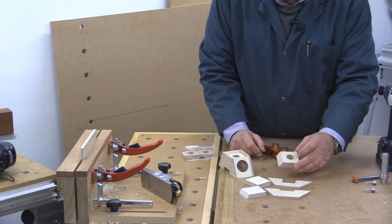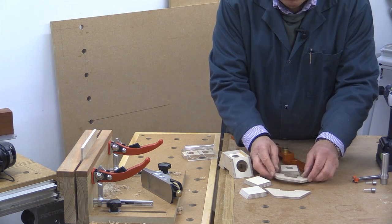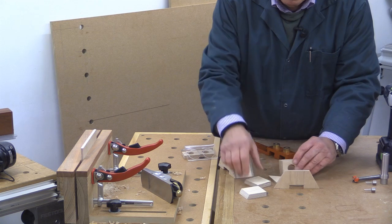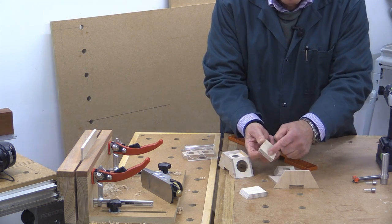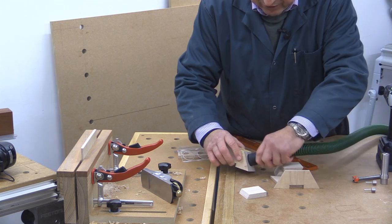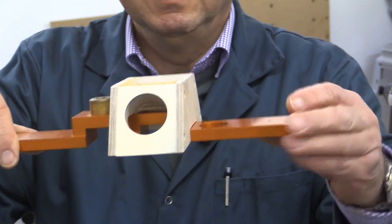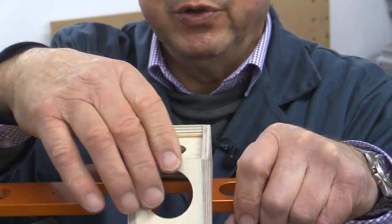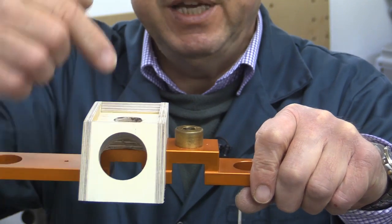All you've got to be able to do is to drill a 22mm hole here and make some cutouts here. The angles of all of these things are 30 degrees or 60, whichever way you look at them. And although I've not drilled them in here, you would have to drill a 35mm hole in this piece. I say 35mm because my Festool hose has an end on it which fits snugly into a 35mm hole. Now, this could be used in either position, either on this one or on this one. All you do is rotate it, and you can put the extraction hose in from either side.